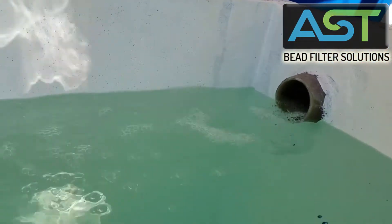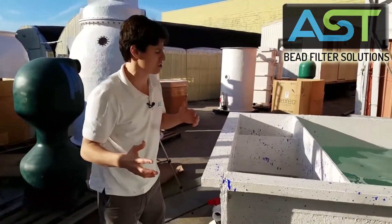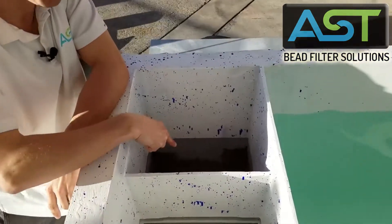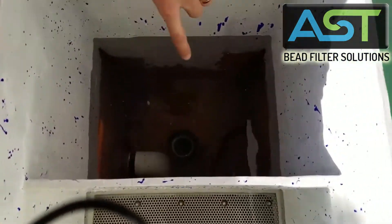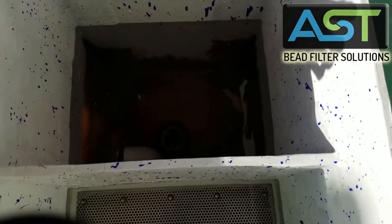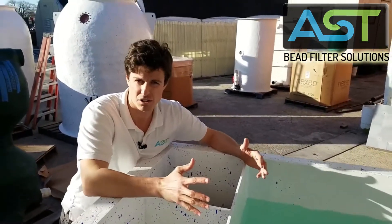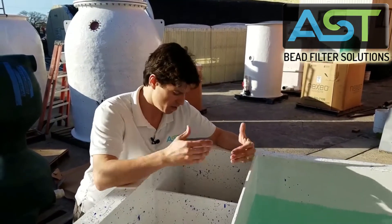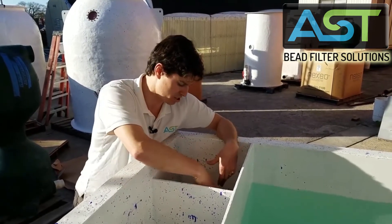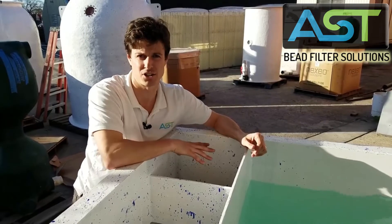Now that is the flow just after a backwash — hands-off backwash. So let's take one last look at what's going on over here. Just after a backwash you'll get automatic sludge discharge. This filter is in the testing phase so there's no sludge being generated right now, but just after a backwash the next thing that happens is sludge is automatically sent out and then isolated in this sludge chamber.